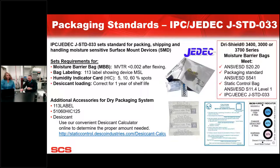It's definitely a total system. When you put all three together, Christine, what it does, if there's any moisture that's left on the component, the desiccant will absorb that while you're transferring the device. Once you've pulled vacuum and sealed that in, you're not only keeping the level of moisture that's in that package at the same rate, but you're also protecting anything from intruding into that package. And then the HIC card pretty much just assures the end user, when they get that device in a vacuum sealed moisture barrier bag, they know what the exposure level was. So it's certainly the best solution in a package.